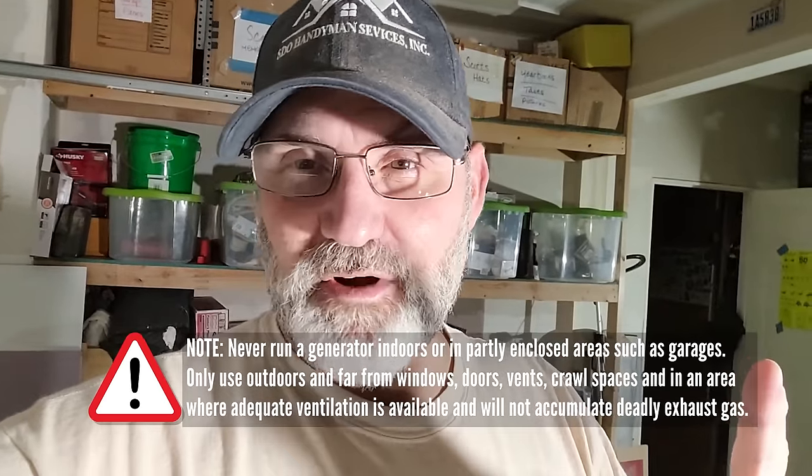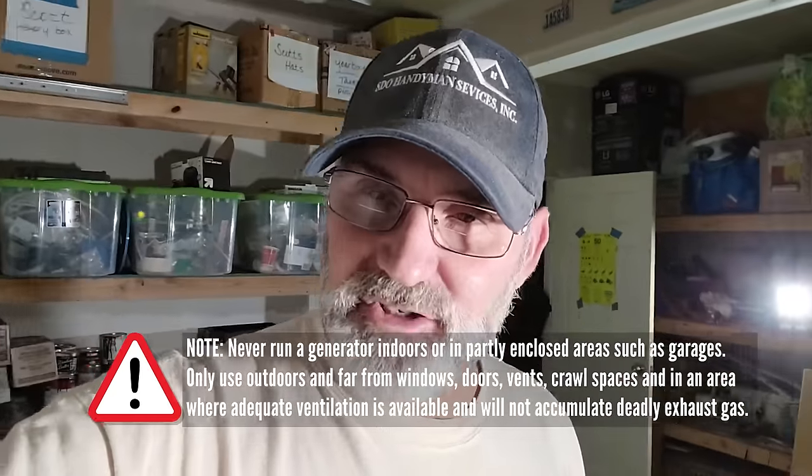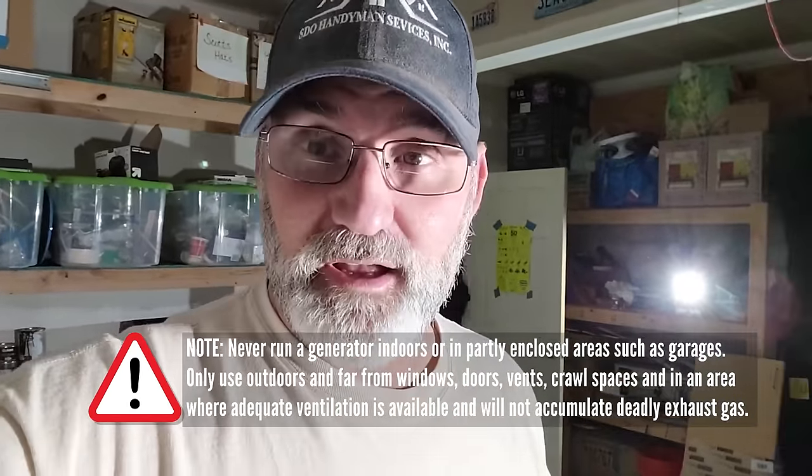A couple of things before I open the garage door, because it's going to be noisy and windy out there. Never run your generator inside the garage — even though it's outside your living space, it's still inside your home, and carbon monoxide can kill you. My generator has a CO monitor and it will shut off if it detects that. But frankly, I'm not going to trust my life and the life of my family to that. So this thing will always be run outside in the driveway where it's safe, and I have a 25-foot cord to hook to the house. The power's out, so I'm going to have to open up the garage door manually.